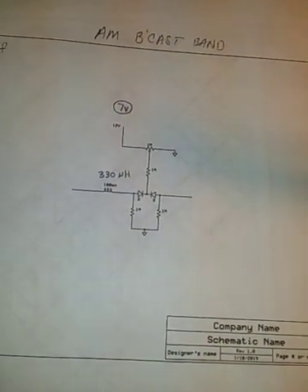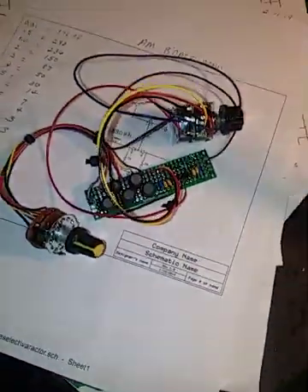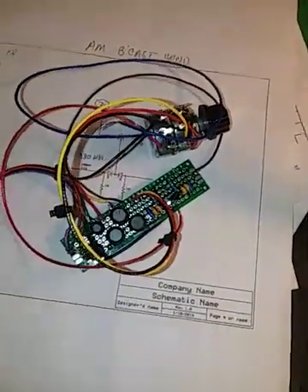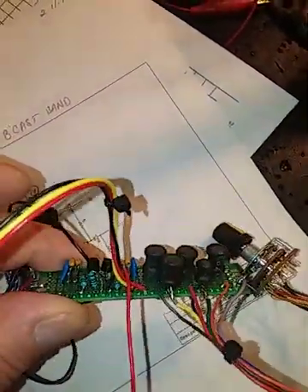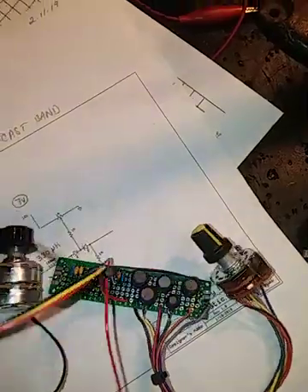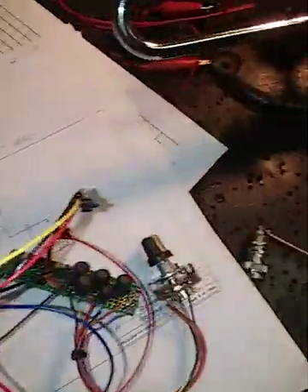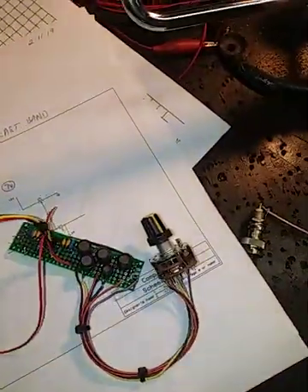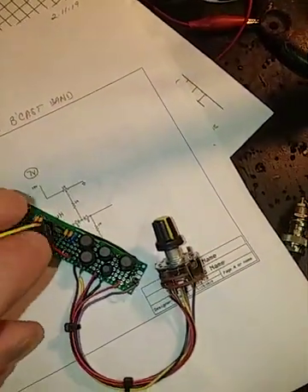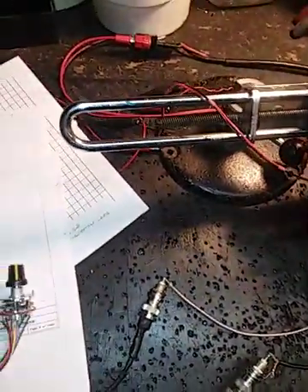It really works. Let me grab the broadband one quickly. Here's a rotary switch — I'm running to a bank of inductors. Here's the pot for voltage control. I'm using a dual pot because I didn't have the right value, but 100k to one leg is fine. There's the switch — it's that simple compared to the broadcast-band-only unit. That's it — Bob, W1KPR.